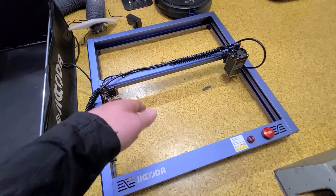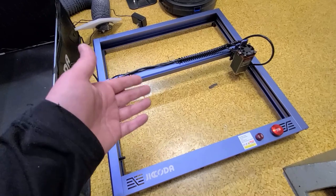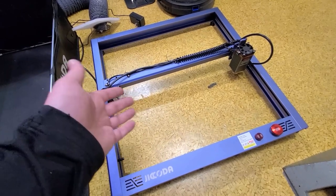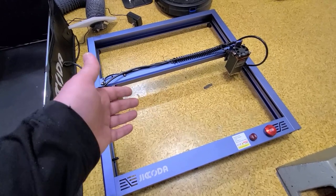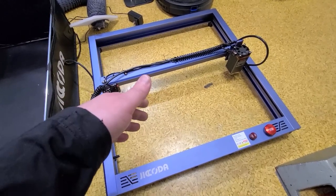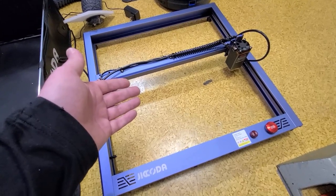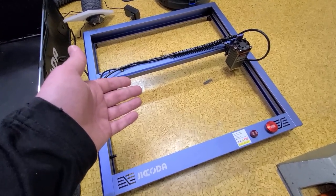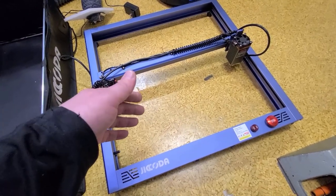Once again, 10 watts, 450 nanometers. Blue lasers interact with materials much more efficiently than infrared lasers. It's just that they are limited in power. Industrial lasers are carbon dioxide, and they get up to 1,000 watts. Carbon dioxide lasers just don't interact with materials very efficiently, but they can be boosted to massive amounts of power. That's why they can have big, heavy-duty steel-cutting lasers.